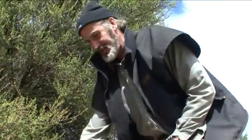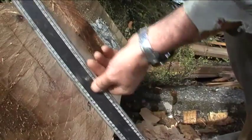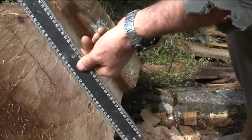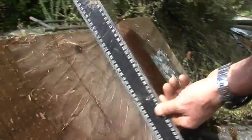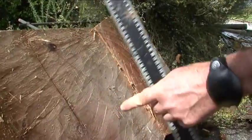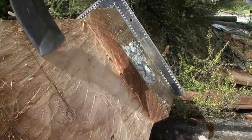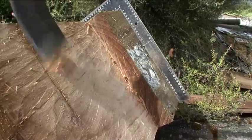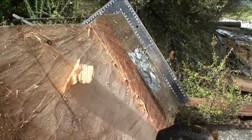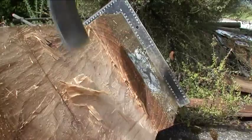We're working to about half a millimetre. You can just see I'm looking for these marks up here, which are telling me where the high spots are creeping in down here. So you can see from here that I've got a high spot up here, so I'll cut down through there, eat into it slowly, and then thicken it out where it needs taken off.